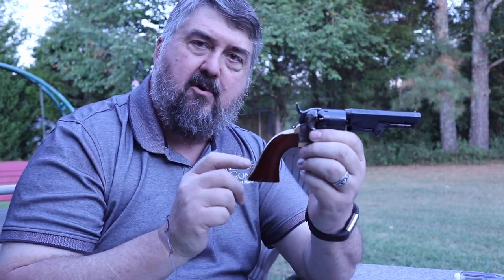What I've found is that if you buy a second mainspring and install it on top of the first one, you'll double the spring weight, and it's very easy to do. It costs about $5 or $6 for the spring. The screw that holds the spring on the inside is plenty long enough to attach two springs.